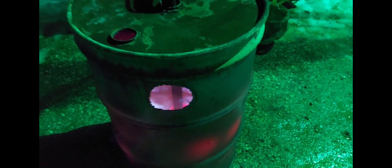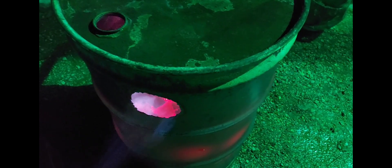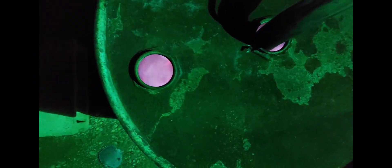Here's just the gravity feed - it's just a half-inch ball valve, a two-liter bottle top. It's all homemade. This stuff shrinks just like shrink wrap when you heat it up - that thing's sealed surprisingly. Anyway, that's how I control the oil going in now. I put a gallon of oil in this thing at five o'clock - it's now about 6:30 or something. Very, very efficient, and you can see nothing but blue flame inside that thing.